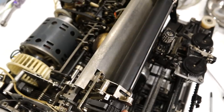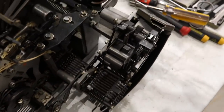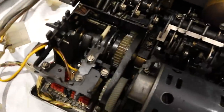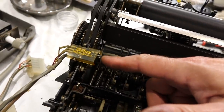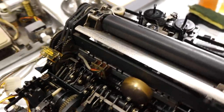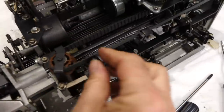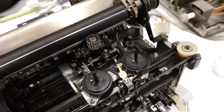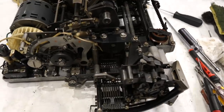This is the carriage and the platen. We also took the entire disassembly apart — so now I have the punch, the back removal, the motor, all nice and clean. This was the toughest area to clean. I corrected a few issues: there was a spring not attached over here, a contact that was bent over there, and a few things like that. One thing was stuck. When you clean thoroughly, you'll find all kinds of issues before you have to find them the first time you run the machine.